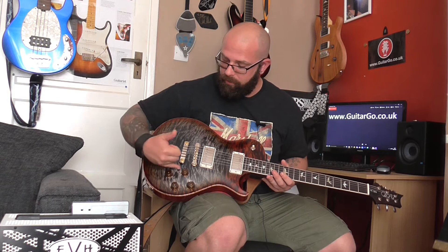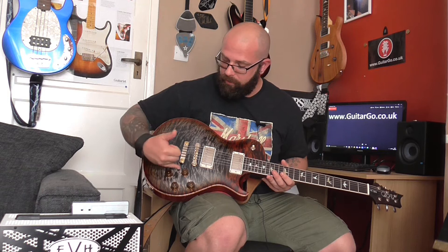It's quite common in ten tops to see perhaps that little dead spot, and that's why they're graded before they're carved. In some exceptional circumstances a guitar may be downgraded or upgraded, but mostly they stick with that original decision. If we look at another ten top here, you can see just how uniform, just how consistent the figuring is across the entire top. I should note that grain and figuring are actually different things. Quilt maple, flamed maple — what people are talking about is the figuring. You can often see, if you look closely, the grain running perpendicularly to the figuring.